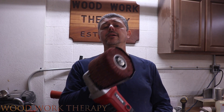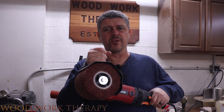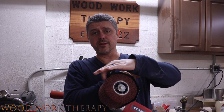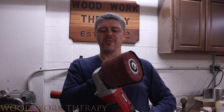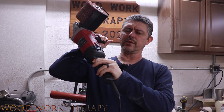Overall, do I think it's a good buy? I think it's a nice luxury tool because you could always do it with a sander. But sanders don't have the curvature that this is going to have, so this is going to make a much better result. And this is way safer than a lot of the live edge tool stuff I've seen for angle grinders. It has a lot of safeties in place to keep your fingers away from the action. And since this is made of a non-metallic material — unless you replace it with a metallic one — you don't really have to worry about severe hand injuries. It's got neat features: your trigger button, and this button here which holds your trigger in so you can just keep grinding away. I didn't really find that I liked it for live edge, but if I was doing a whole table surface, I'd definitely want to use that.